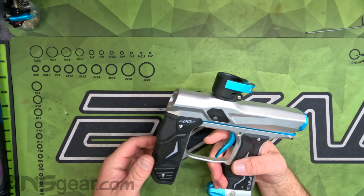All right, so we've got the top of the core right there. That's the part that you can see. There's the inside of the core right there. So those parts come together. Sometimes you'll get a leak out of this and it'll be leaking out the bottom right here. You can replace typically this O-ring, and this O-ring right here caused that leak through the bottom. This one just seals these two pieces together. So it's rare that this O-ring goes bad. Also, this O-ring right here, this is what the pin rides through on this one. And there's our pin inside there. Pin rides through that O-ring right there.